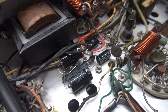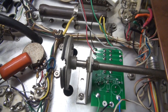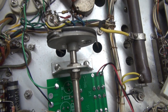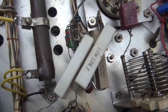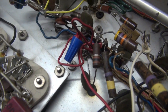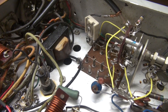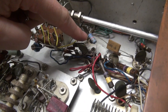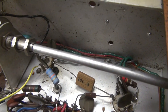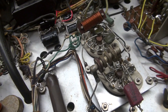I've also put in the D-Lab K1 push-to-talk module. I need to get that wired in and then we'll give this thing an initial test and set the modulator current. The new push-to-talk system is installed. Now I want to correct these two 10k resistors going over to this added terminal board — I've got an original 20k to put in its place. I also have to fix the old wire-nut job. I still have not cleaned up the crystal selector, but I did change out this resistor which should be a 68k — somebody had a series trio going trying to accomplish the same thing. I just want to see if the power supply is operating properly.